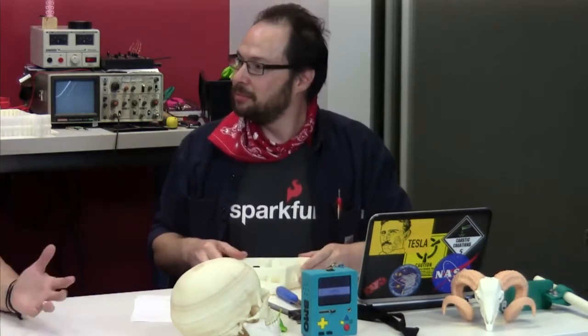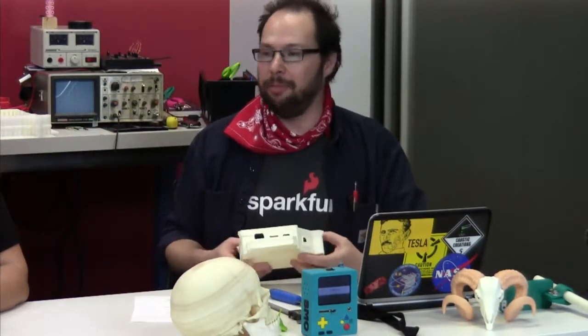There are also different filaments that work better in different environments. There are ones that are more affected by temperature. ABS, as common as it is, is very temperamental when it comes to cooling, so maybe you want to go with something like PLA, which is very dimensionally stable, or the high impact polystyrene. Some of the copolyesters as well. We carry a couple that are specifically made to take care of some of those issues. NGen and Innova 1800 are both really good copolyesters that alleviate some of those issues. Another advantage to those engineering copolymers is they have really great impact strength. So if you're clumsy and you tend to drop things, you have a better chance of survival of your piece.